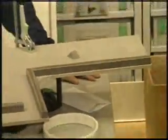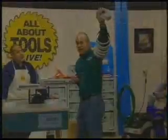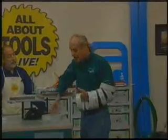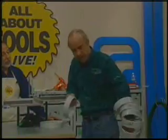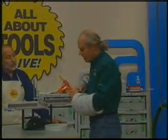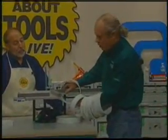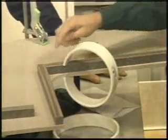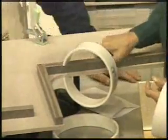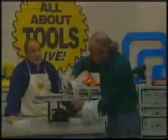Now the secret of applying Danny clamps: one thing you can do is carry a lot of clamps on one arm at a time so you don't have to keep grabbing something. The other thing is they don't hold dirt. Everything falls out. When you apply a Danny clamp, it's very easy. You put the clamp on and you move your workpiece where you want it and you wiggle the clamp. When you wiggle the clamp, it aligns the top and the bottom of the clamp so your workpiece doesn't scoot on you. And you put 2 clamps far apart on a corner like this, you take 2 like this.